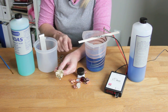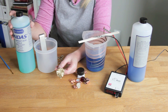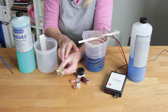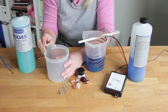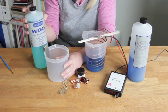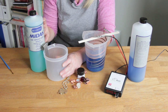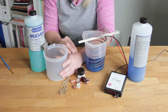You can also use the Duo controller to plate other metals such as gold, silver, and other appropriate metals as long as you use the proper solution. I've got a leaf that's been gold plated here — these only take a few minutes. Instead of a copper anode, you use the appropriate anode for your solution. In this case I've got a stainless steel anode that works well with a 14-karat gold solution. Keep your current on a very low setting and follow the manufacturer's directions about agitation or heat as necessary.